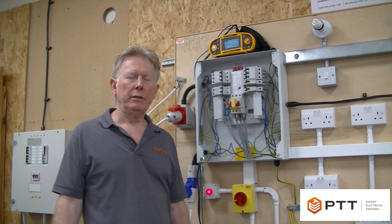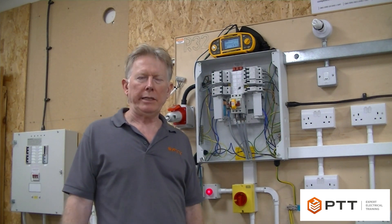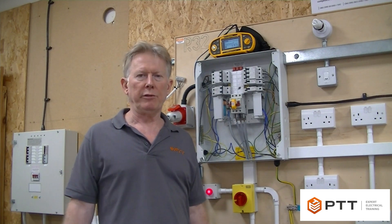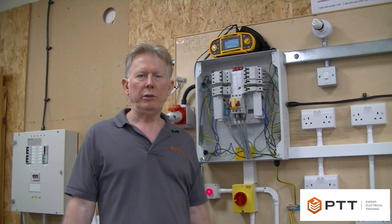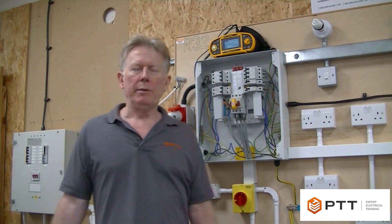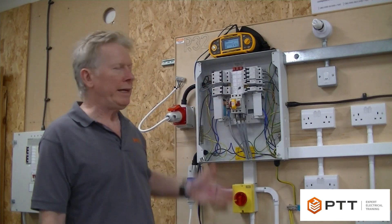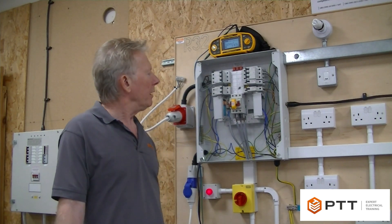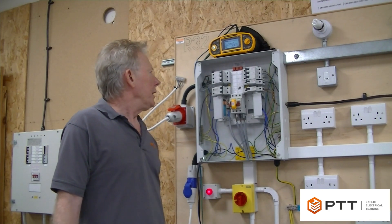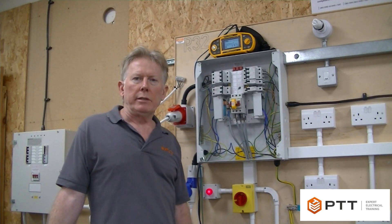We're going to have a look at performing a ZE test, or earth fault loop impedance test, on this three-phase board. We do ZE testing to check that we have continuity, that we have an earth, and that it's below a defined value — which for TNCS should be 0.35, and for TNS should be 0.8. I'm also going to follow on by doing the prospective fault current test, to make sure these breakers can make or break a current under the most dangerous circumstances. We need to test that at every relevant point — generally the origin — but also any point where an overcurrent protective device needs to operate under fault conditions.